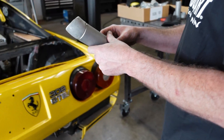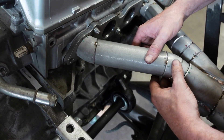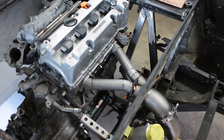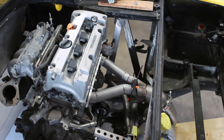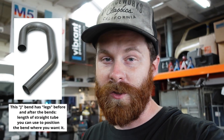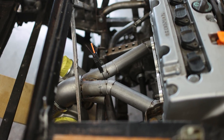It fits like a glove. I've got two primaries done. I like to imagine they're the two difficult ones. It's a bit more challenging than I expected. I've done a decent bit of work with normal stainless tubing that has legs on it, and without legs to work with you are really limited in how you can run from one point to another. It requires more pieces to do it, but I think some of that experience has helped. It's not perfectly symmetric, but that wasn't something I was anticipating. On to the next two — let's get them done.